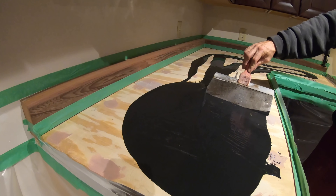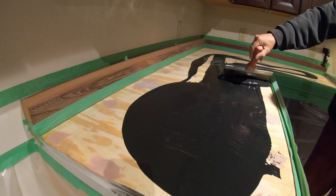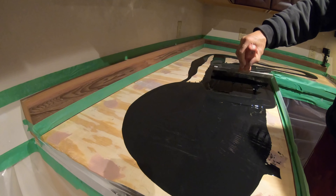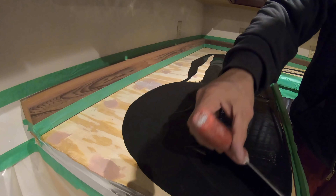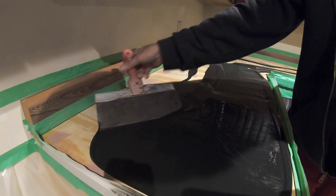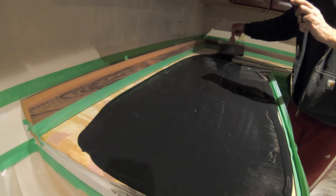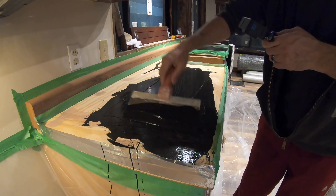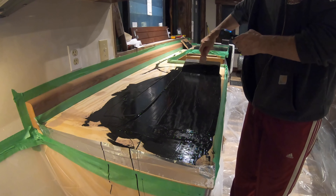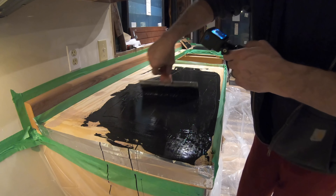This is no secret ingredient either — it's just straight black paint. I want to lay down a coat of black underneath so that if any of the coloring doesn't fully cover this countertop, I want black to be the reveal color. I'm just putting it on with a trowel simply because I had a trowel handy and didn't have a paintbrush handy.